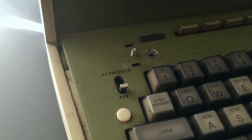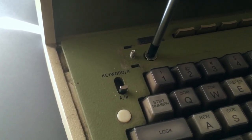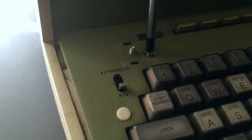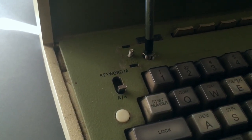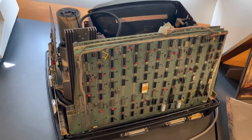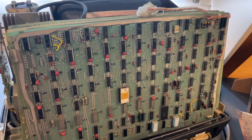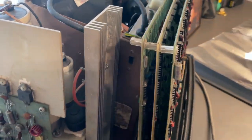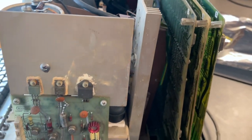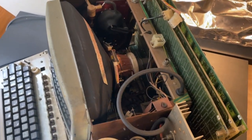When you remove this strip, right underneath there are the two screws that secure the part of the case covering the keyboard. So to disassemble the thing you have to remove those two screws. With the case off, we see that there are three cards. This first card is responsible for the I/O, including generating the video signal. There's a huge heatsink. This little board is the power supply board, responsible for generating the six power rails.